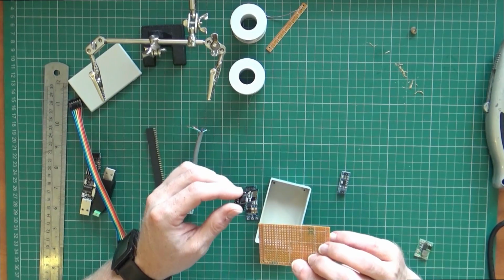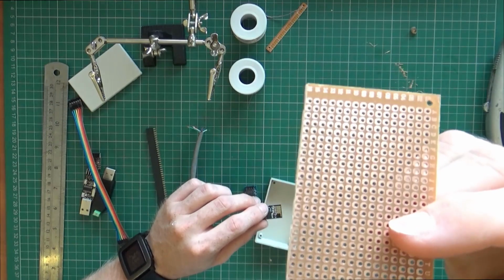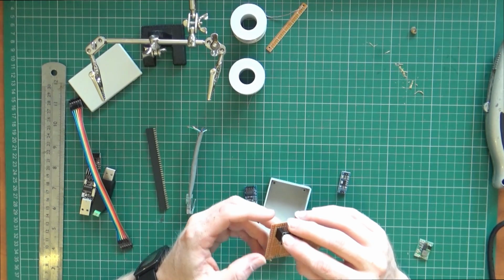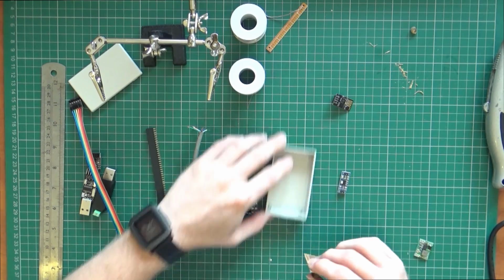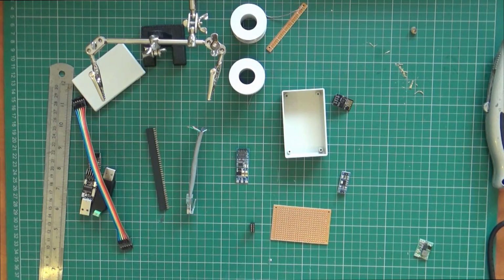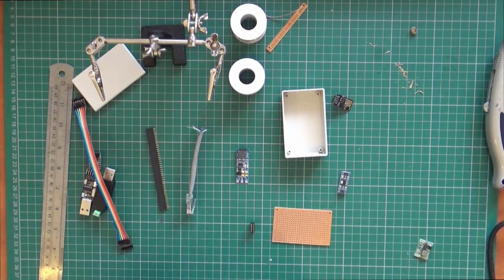So now the problem always is with these, that is what I hate, it's one-sided. So you've got some copper pads there, but one-sided there. So what we're going to have to do is do all the connections on the back side of the board. And what I might actually try, which might seem silly, is I might try applying some flux. Now I know it's flat pads and it should stick, but with these particular ones I tend to have nothing but problems. Absolute pain.